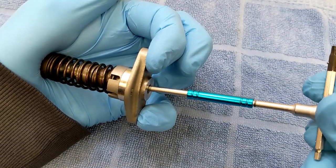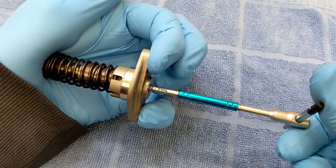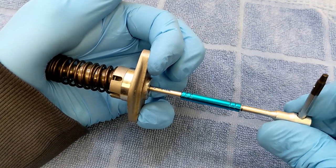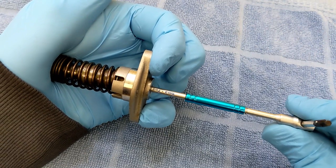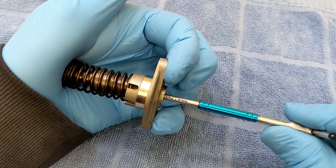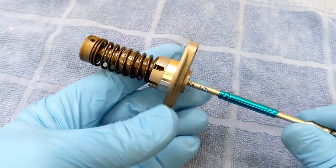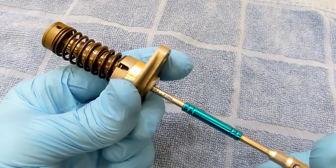While you're doing that, you put a 3mm allen key in here, and while you're squeezing, you turn counterclockwise. Once you get it started, if you leave the allen key in and release the pressure on your hand, it stays, and you can actually just keep turning.